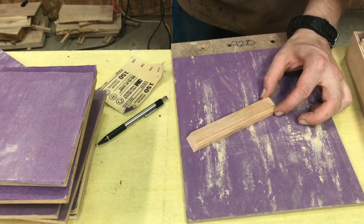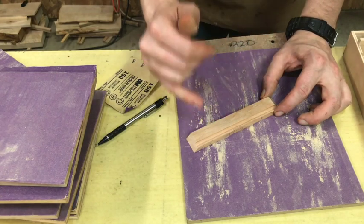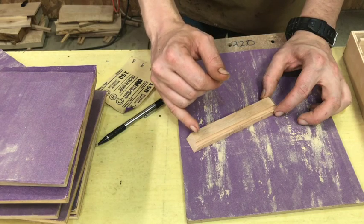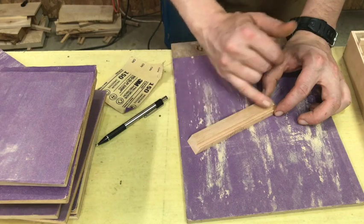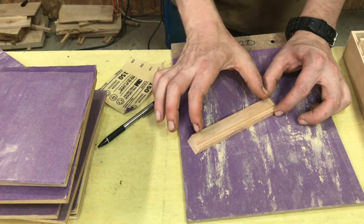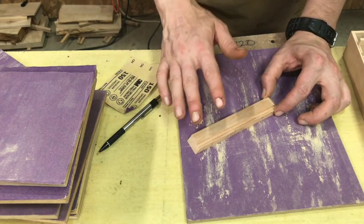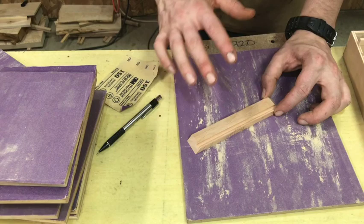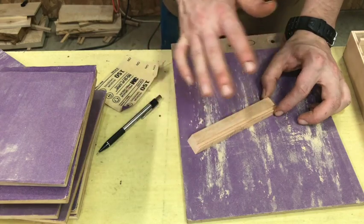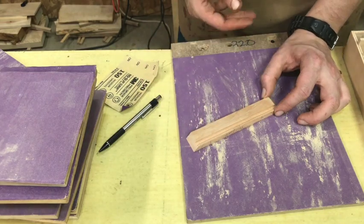The one thing that can stop me from doing steel wool sometimes is that it becomes very noticeable where you did and didn't do the steel wool. So if you've gone and you're a little problematic over on these ends here and you steel wool in the middle here, there will be a noticeably shinier spot from here to here without in the corners. So take that into consideration when you're sanding, that if you want to get that burnished look, that incredibly almost glass plasticky look just from sanding, that you have to do all of it. You can't just do the middle parts or else the corners will be noticeably more dull, less reflective.